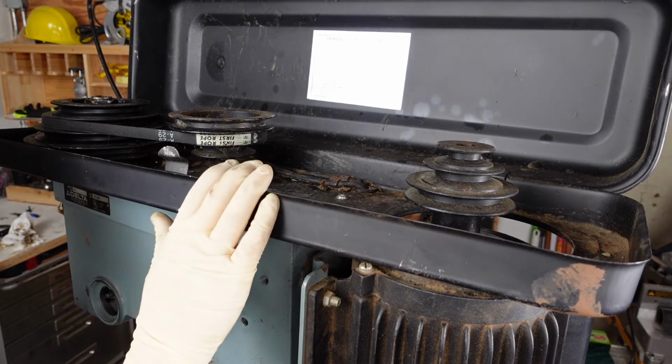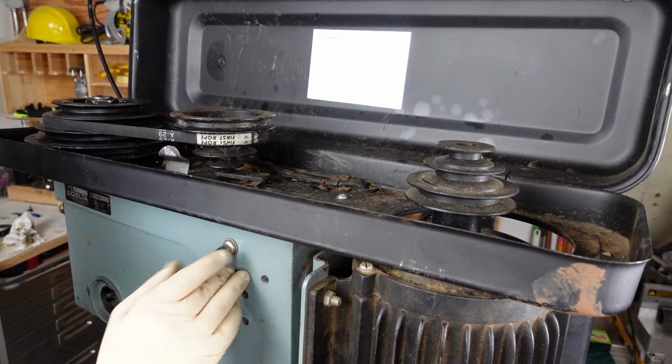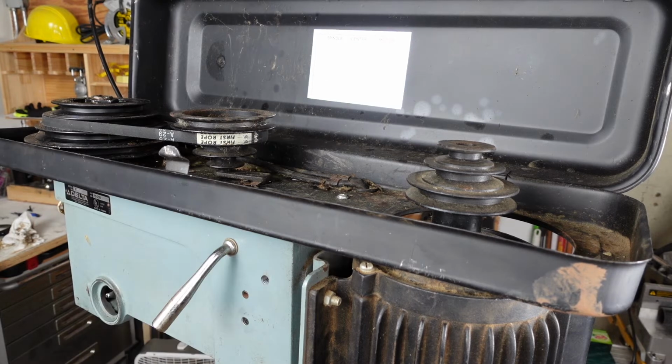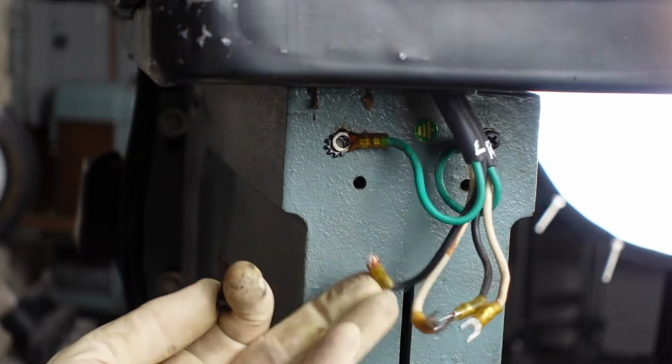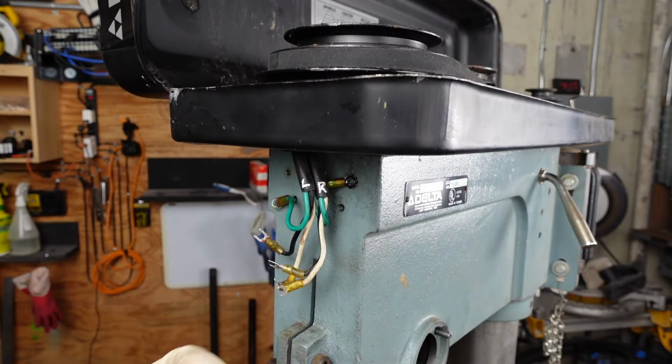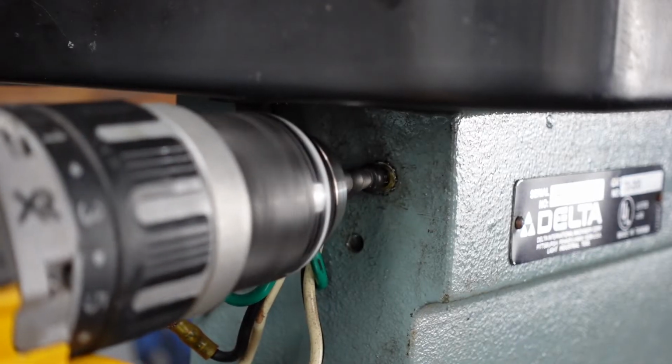So to remove this thing, we've got to take these little clamp guys off, clean up the rusted edges right here, clean this guy up, and we'll seal it and decide whether we want to paint it or not. Moving over to the grounding screws, the left side came out perfectly, but the right one not so much. I had to use a screw extractor kit to basically bore out the center of the screw, and then flip the bit to the reverse threads to remove the stripped screw.